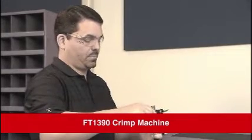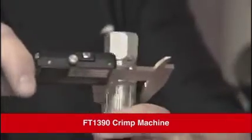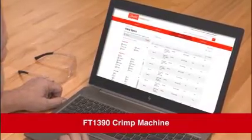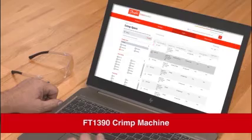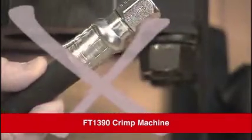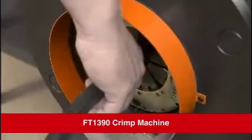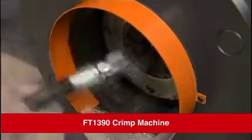Once the crimp has been completed, measure the nominal crimp diameter using calipers or a point micrometer. Readings should be taken across all 4 sets of flats and averaged. Compare the reading to the specification listed in the Power Source Crimp Spec tool. If the crimp is not correct, follow the previously described steps to ensure that an accurate crimp diameter is achieved. Once you have a proper crimp, this assembly procedure may now be repeated for the other hose end by following the identical steps used for the first crimp fitting.